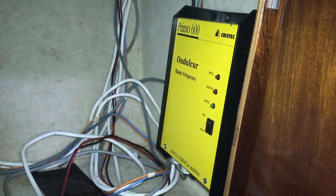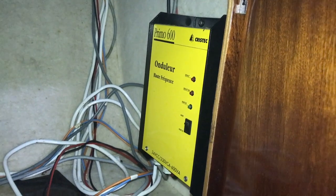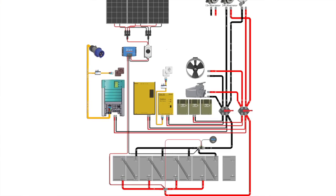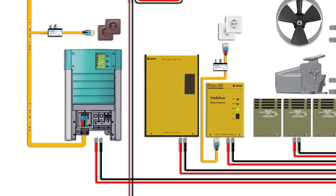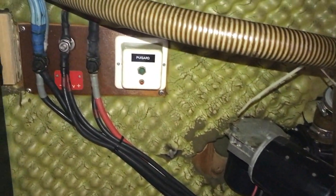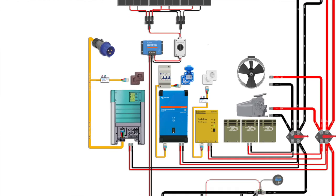So that was the battery swap. Next was the inverter upgrade. In the end we decided to keep the small inverter and add an additional one. The cable run from the battery bank to the engine bay is as difficult as they come, but by a sheer stroke of luck there was a redundant transformer — a 24 volt to 32 volt transformer — in the engine bay. It was still wired to the batteries. Why the previous owner wanted a 32 volt transformer I have no idea — I don't know what runs on 32 volts. But it meant we had cables in place going to terminals inside the engine bay, so I could remove that old transformer and use the cables and the space for the new Victron inverter.